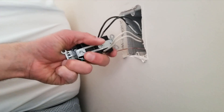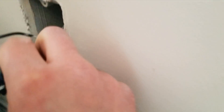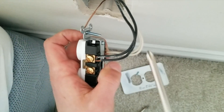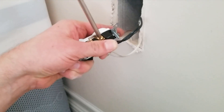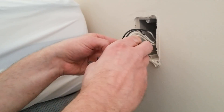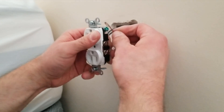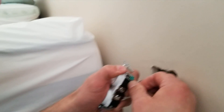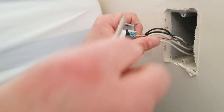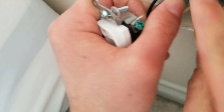Sometimes there's a little bit too much copper exposed and you might have to trim it back — too much exposed copper can cause it to ground out. Tighten it nice and tight, around 20 to 30 inch-pounds, but it can't move — you don't want it to come undone. Then put the bare copper ground wire onto the green screw. A piece of copper wire with no insulation is your ground wire; the ground screw is green.